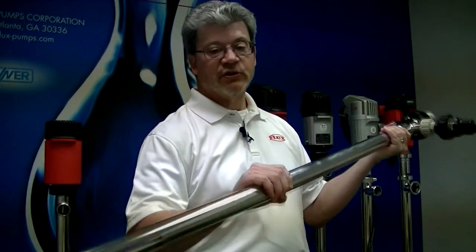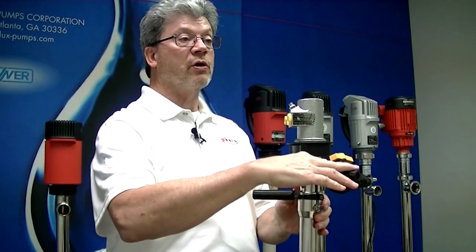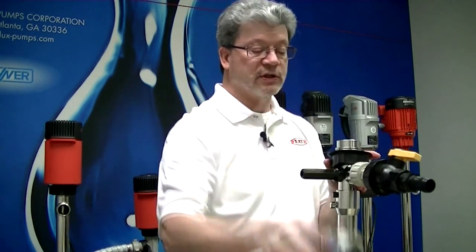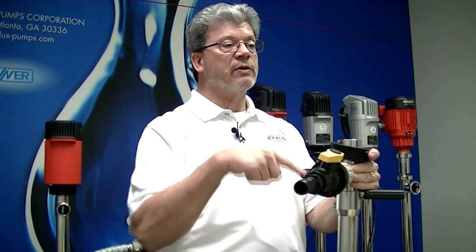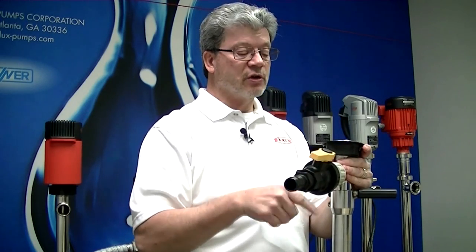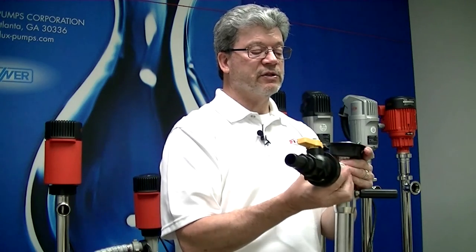You can see there are holes in this tube, and we have levers here that will open or close those holes. To begin, we immerse this into the drum and turn on the motor — I'm just going to remove the motor for simplicity. When we turn that motor on, we start mixing. The product comes up the tube and out the holes, providing some pretty good mixing action. We'll want a valve on the discharge, otherwise you will start pumping while you're mixing. So when in mix-only mode, a valve on the discharge is something that needs to be considered.